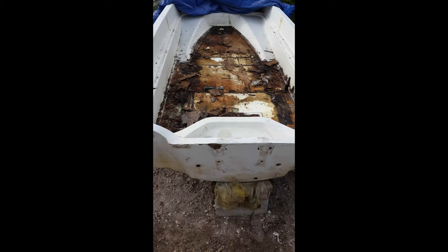I then gave it a good wash and scrub to get a good idea of the condition of the gel coat. The floor had a lot of screw holes, so it would need to be changed — I noticed that before I bought the boat. After letting the boat dry in the hot sun, I got out the grinder and began cutting away the top layer of fiberglass on the floor, peeled that away, and did the same to the plywood underneath, as you can see in this picture.